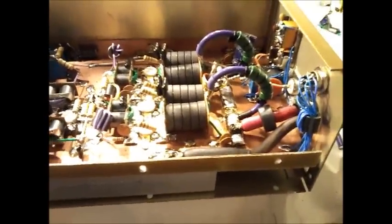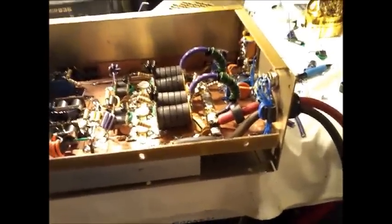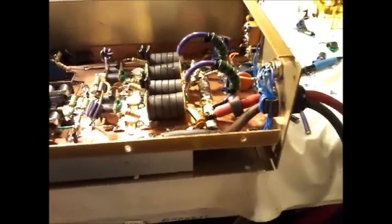Just do not use aluminum clad copper or copper clad aluminum. It's real hard to work with to get it soldered. It's okay to use it if you're going to be crimping something or screwing it into a connector or something like that. It's perfectly fine to use it that way. But just when it comes to soldering, that's all I'm talking about.